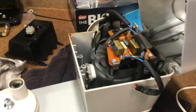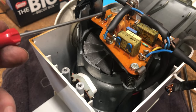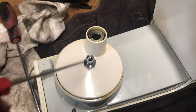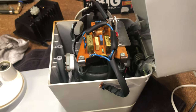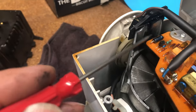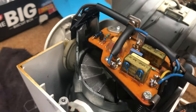The motor controller must still be working because the motor's going around and I can vary the speed. There used to be a kit for about 30 pounds you could get for this particular model — a kit of two or three capacitors, a power transistor, and I think it included some grease for the gearbox and motor brushes. It hasn't had excessive use, so what I'm going to do is get online and order two or three capacitors. There's an old electrolytic at the back — I'll get a new one of those. I won't worry too much about the semiconductors — two transistors — I'm going to leave those.